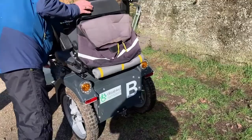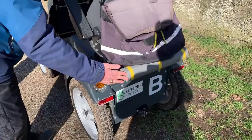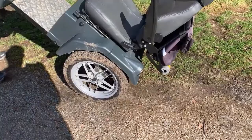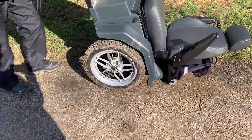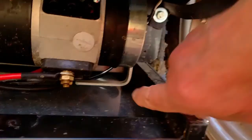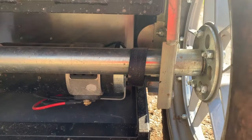We move the seat back so that the end of the bar goes onto the ground as we lift up. From the front, very carefully, lift it up all the way back so it rests and is quite stable there. Coming round — this is the brake lever, the freewheeling lever — and it's really difficult to operate. You can't operate it in this position because the tramper would run away when you try to move it. That's the lever and you have to get at it with some difficulty.